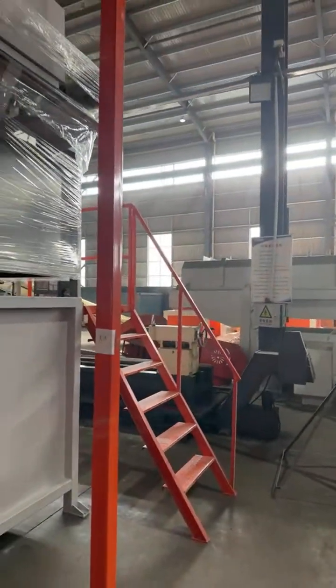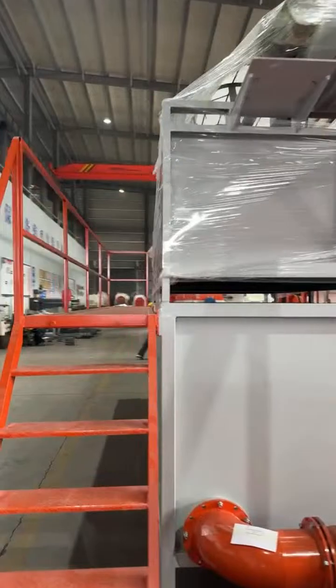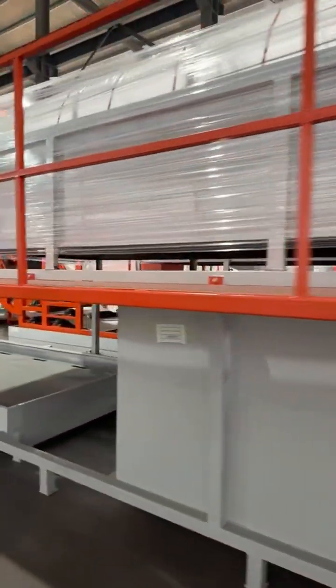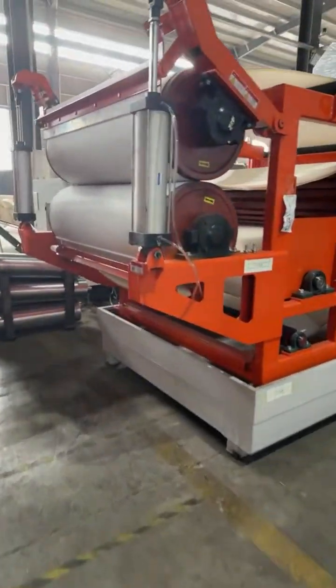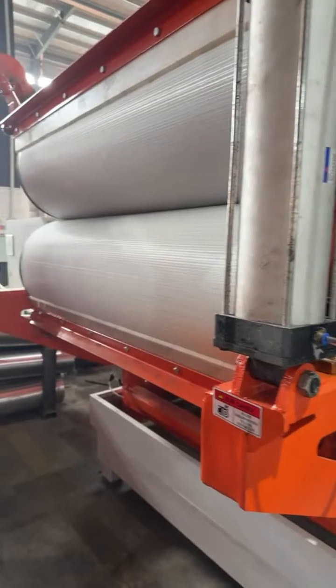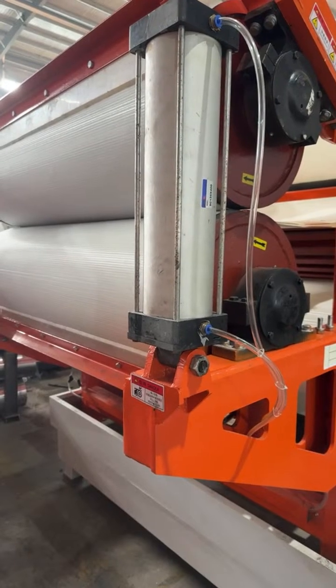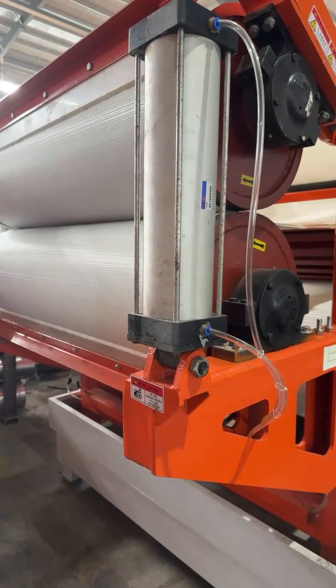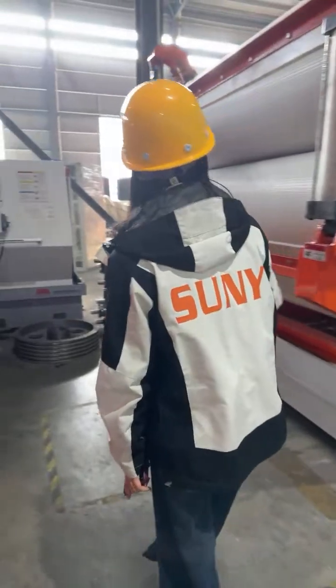We packed it with the plastic film already. Under each dehydrator, we have made a special pulp collection tank for you. And here you see that's your other set of pulp filter press equipment. Someone asked, after the press machine, how much moisture will remain? Around 60%, okay? 60%.